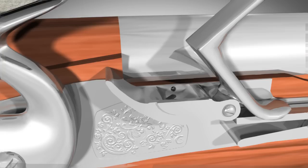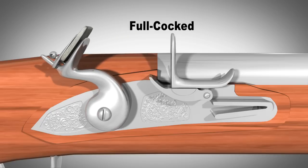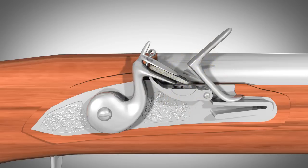At this point, the user would place gunpowder into the pan and then move the frizzen down to cover it. In the half-cocked position, you can load the gun. The trigger is locked and cannot release. When the hammer is moved into the fully-cocked position, it is ready to fire. When you fire the gun, the flint strikes the frizzen and shaves off iron to create sparks. The hammer's impact also snaps the frizzen back to expose the gunpowder in the pan.